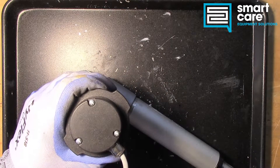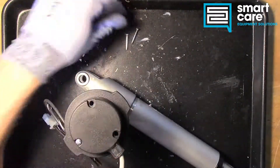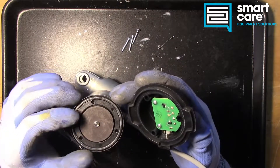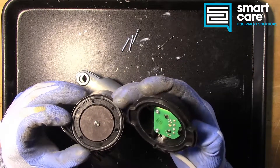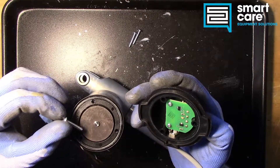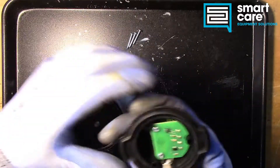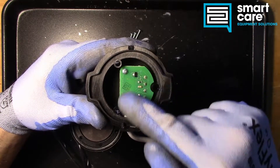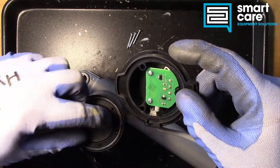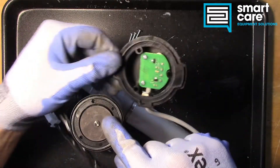Let's start by opening up this encoder. You can see it's pretty simple as far as how it's put together. This is going to be a magnet — like a rare earth magnet — and there's a little bit of magnetic attraction there. As it turns, it's being picked up by sensors in this board, probably like a Hall effect sensor, that are reporting back how many times they sensed the magnetic field rotate. So it's going to report those pulses back to the control as this rotates.